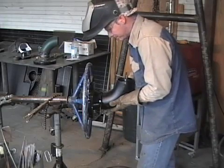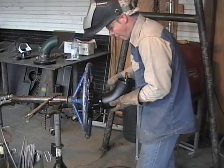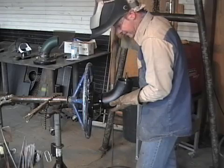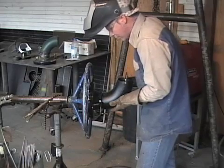That's level right there. Now when I pull off this time, I'm going to draw my heat back over what I've already welded to get my heat in the center, instead of pulling it off on one side.